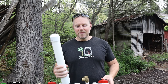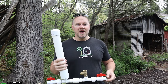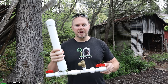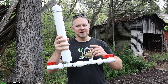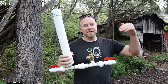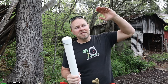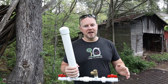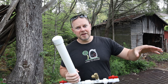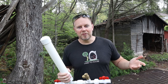The next is the flow rate. The half-inch pump is going to need two gallons per minute to operate. Even if you had 30 gallons flowing in your creek, that two gallons per minute is what you need to operate this pump. The third thing to consider is the lift height. For every one foot of drop going into the pump, it will lift seven feet out. So if you're going to be lifting to 70 feet in the air, you're going to have to have 10, maybe even 11 feet of head pressure going in. I'm only lifting to about 10 feet, so the initial three feet of head pressure is all I'm going to need.